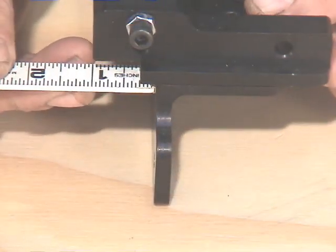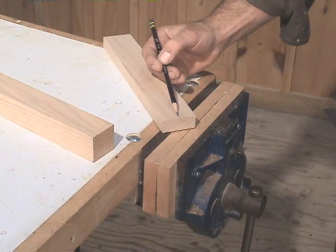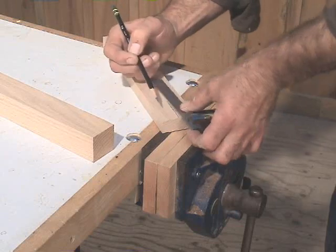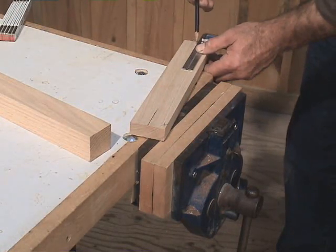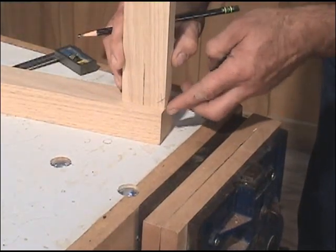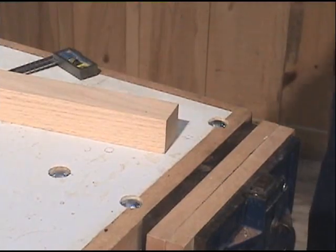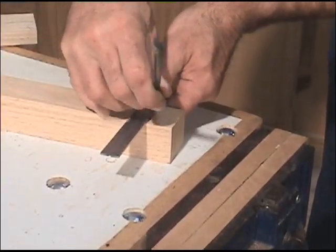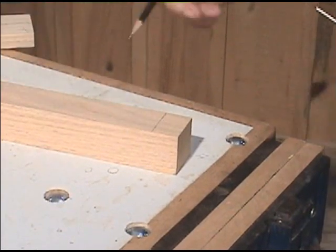An alternative method for positioning the carriage plate is to measure from the base to the edge of the plate — again, this is the distance to the center of the mortise. Mark the mortise location on the face of the material. This line indicates the center of the mortise. Make an X indicating what will be the top edge of the material. Make the same layout marks on the opposite end of the piece, then transfer the layout lines from the first piece to the mating piece, pulling the top edge flush with the end. This layout line is the outside face of the leg; the mortise will be on the inside face. Mark out all your pieces in this manner.